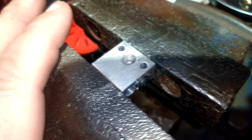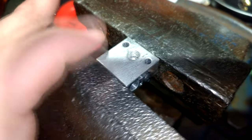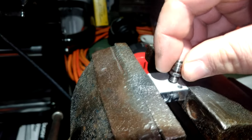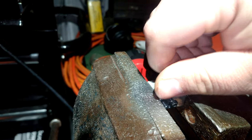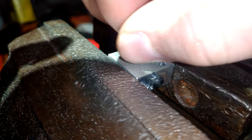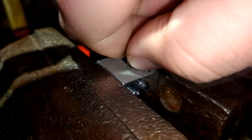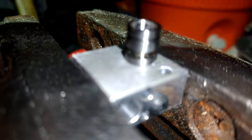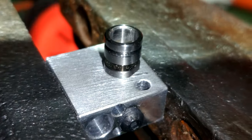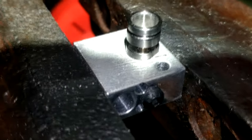Take the time, wire it down, get it nice and clean. Don't worry about the finish — the finish really doesn't matter, you just want to get the plastic off. Now that we've cleaned it up more, you can see by screwing it in by hand how far down we get. We have successfully bottomed the heat break into the heat block — brilliant. Now we just need to do the same thing to the other side with the nozzle.